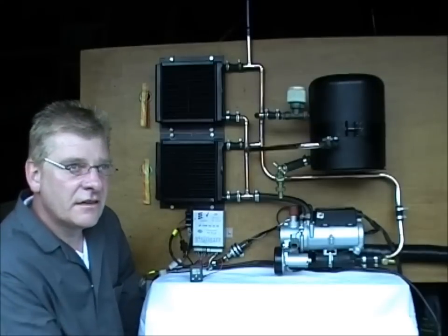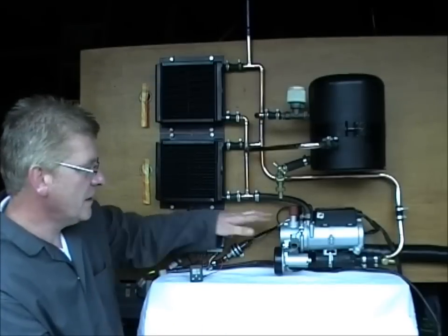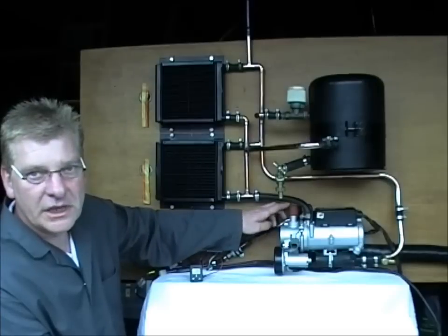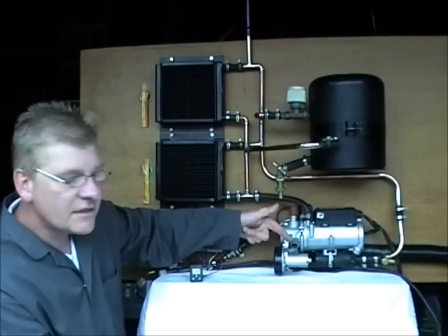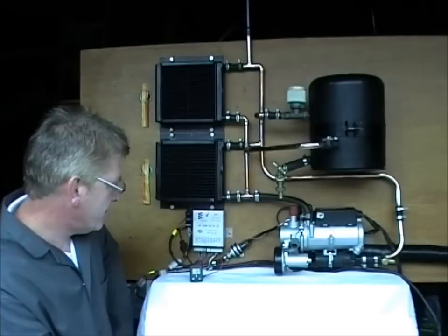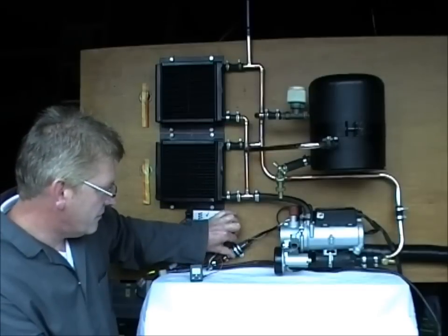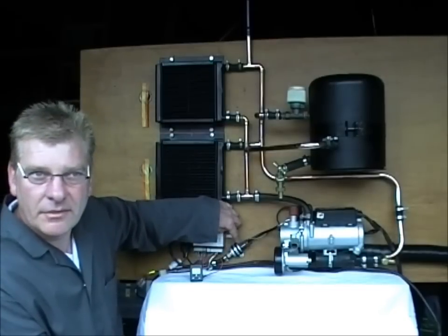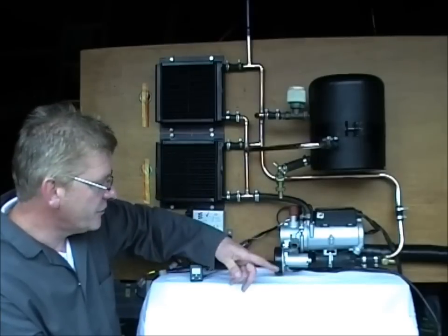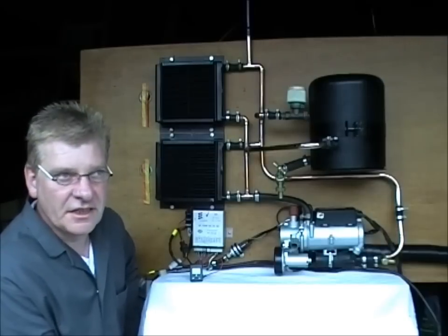and the heater is now starting to go through its pre-start. It's slowed down, you can hear that from the tone of the heater. The glow plug is now on. This is the exhaust, and you'll see how clean it starts in a minute. It takes around 30 seconds, 40 seconds for the pump. You may just hear the clicking now, that's come in, and it's going to just ignite it, and it's going to run into boost mode to get the water up to 60 degrees.